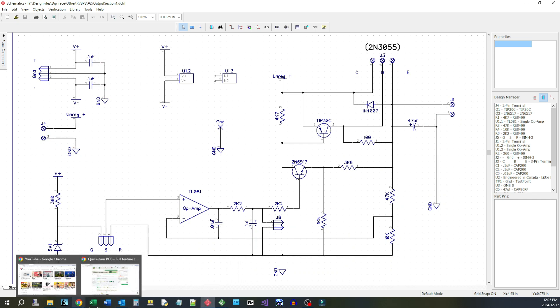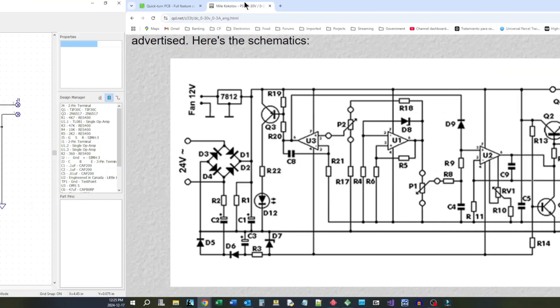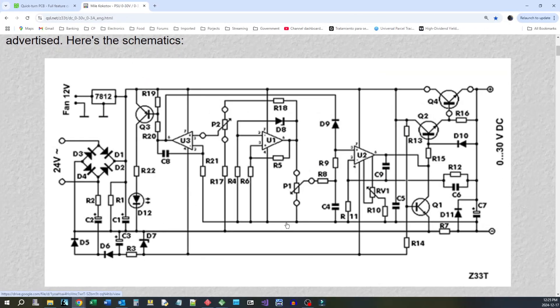One of the things I'm doing differently here — if you recall that power supply I worked on a few videos back, I'll put a link to it up above — this one had a bunch of trouble. It was supposed to be a zero to 30 volt DC power supply but we could only get really 20 volts out of it. One reason was the emitter follower arrangement using a single supply forced the op-amps to run at the unregulated input voltage, putting over 40 volts across them. Then there's a considerable drop across the Darlington emitter follower — about a volt and a half — so we barely got 20 volts out of it. It's not a great way to do it.